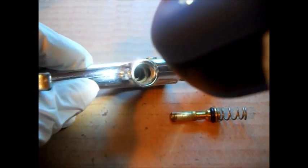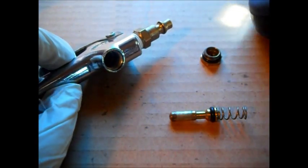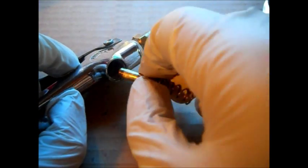How the air goes in and goes down. Well, I'm wrong. Yeah, the air goes down and goes that way. So there's your air coming in. But that's that cavity in there. So scrub that clean. Don't use any sandpaper. You could use some like 4/0 steel wool and put in there if you flushed it out real good. That's all I did, is I put that in there.